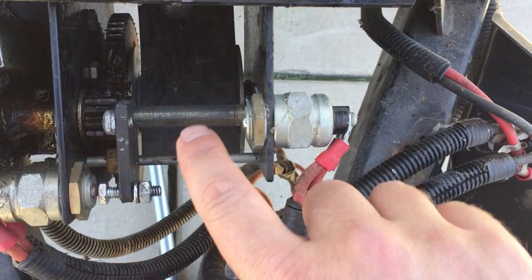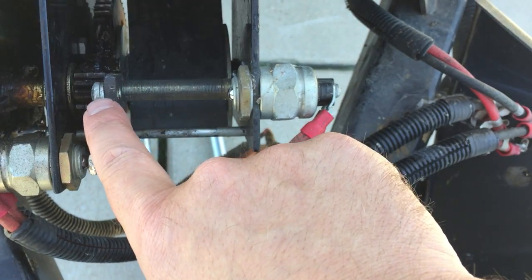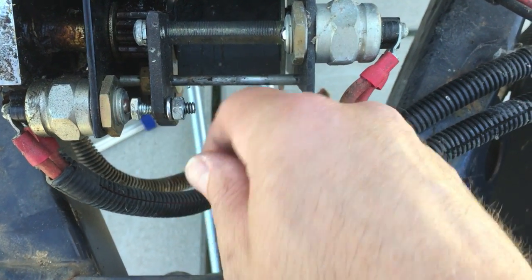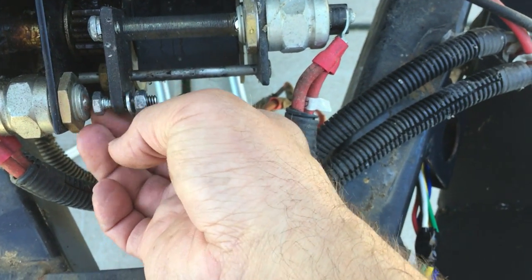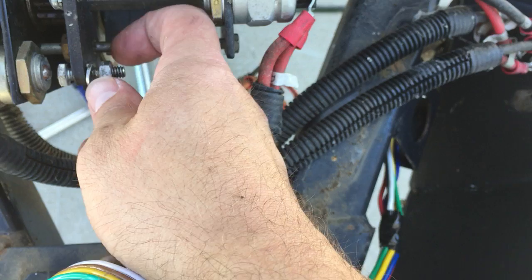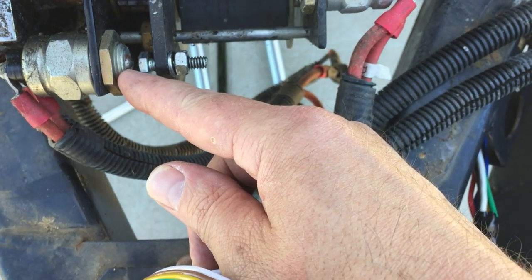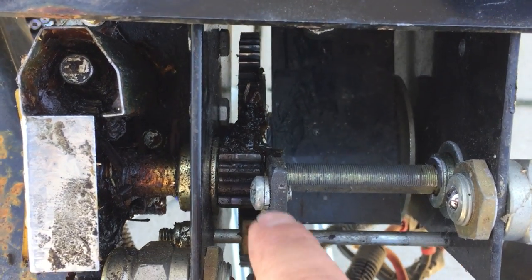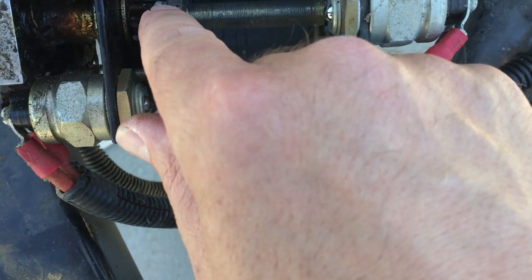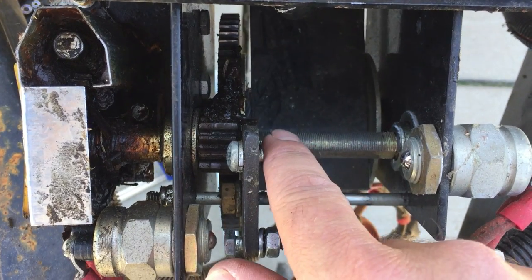What you've got here is a couple of relays. You've got this one here which is your travel adjustment — when this screw inside presses it, it stops going down — and this one is the travel stop for the height. You can back this out and there's a locking nut, and you just run this bolt in to lock it from striking the contact. I've pretty much run out of travel room, so I've backed this out to show you the adjustment piece, but I have it up a couple millimeters from the end of this travel rail.